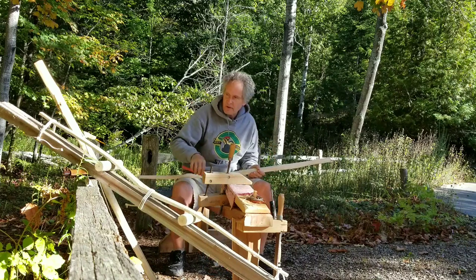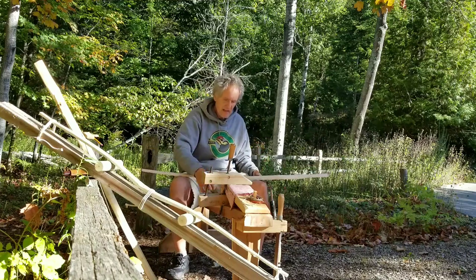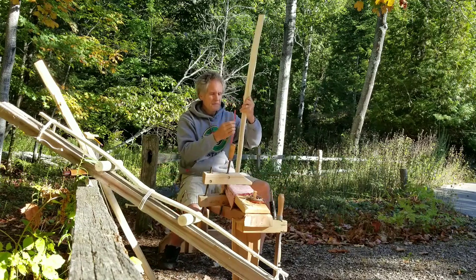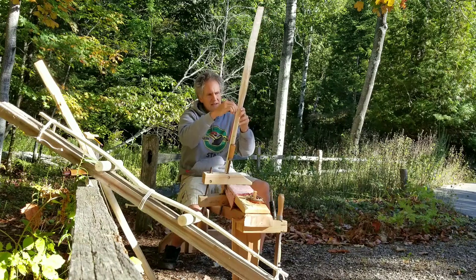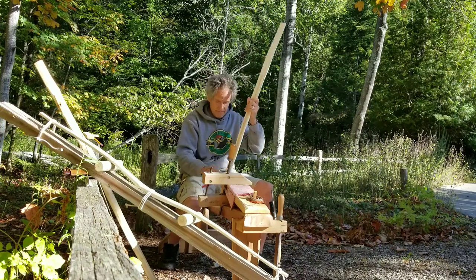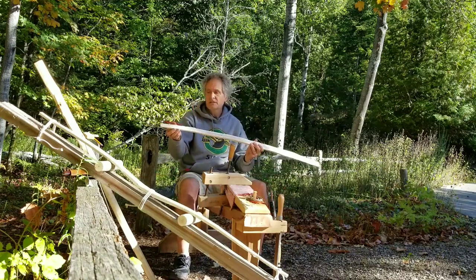In the past, before I had a scribing tool to just follow along here to make it super easy, I would just take strips of cardstock. This is my 1/2 inch one. And I would mark, being very careful, putting it against the back and then scribing or drawing a line following that, following all the curves and undulations the whole way down. You could do it beyond that. You could make a narrower one for the tips.